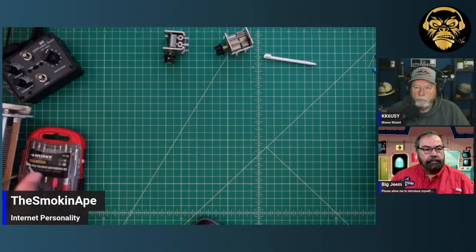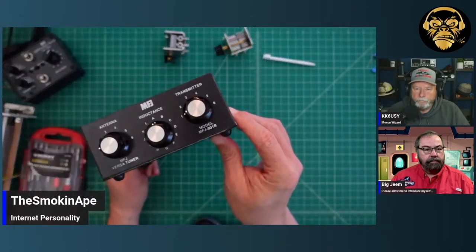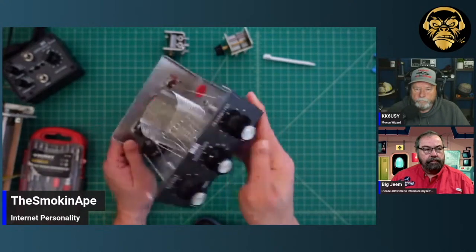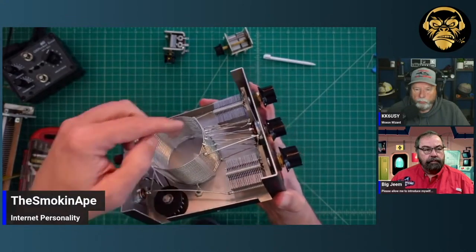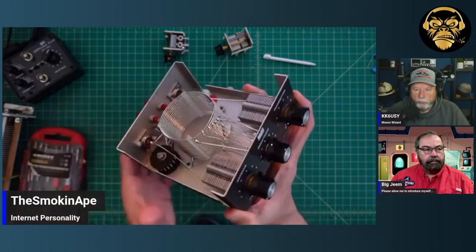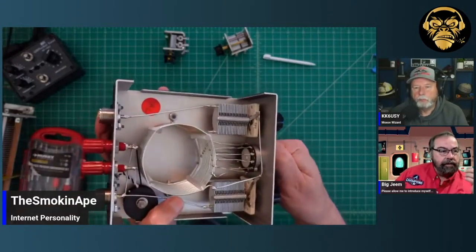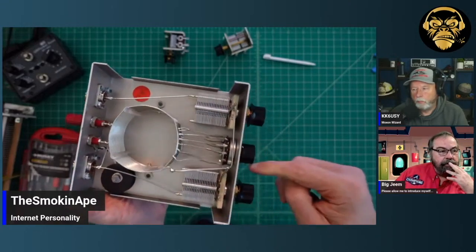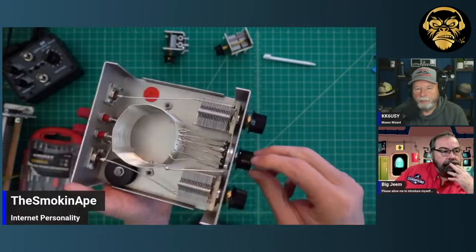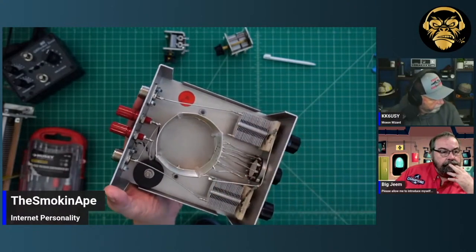In this tuner we're going to take a quick look at — this is the one we were looking at earlier, it's the 901B. It has a tapped inductor, so you see the coil here and it has all these fixed positions. That's a T-network all day because there's your two capacitors on either side with the inductor in the middle. As I change the inductance value here, I'm selecting a different point on the coil for the amount of inductance in the circuit.